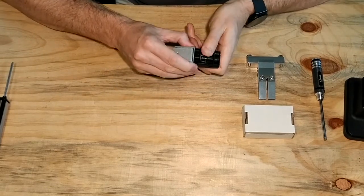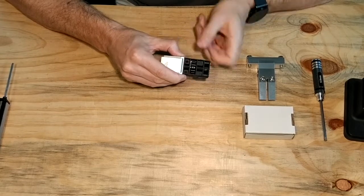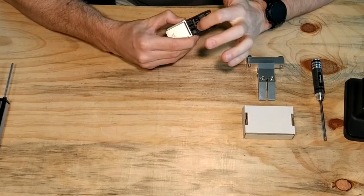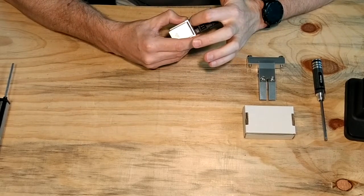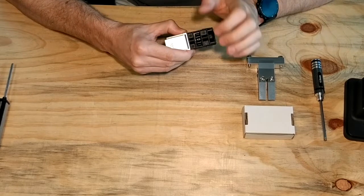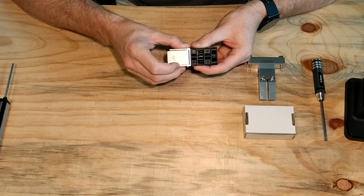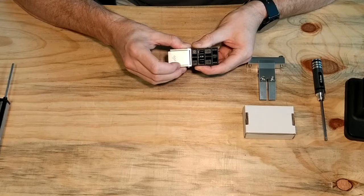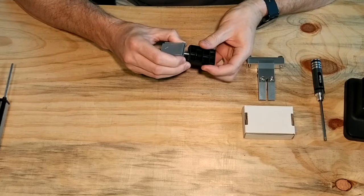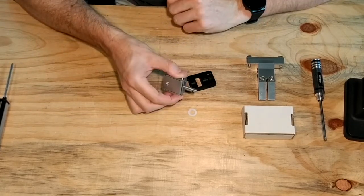Now we'll be unscrewing the thumb nut. If you've never disassembled the Workshop Precision Adjust clamp, there's a slight layer of weak glue, or it could even be the paint of the metal part itself, attaching itself to the clamp holder, but with a slight pry twisting motion you could separate the two. Let's remove the thumb screw completely and the original clamp.